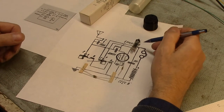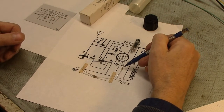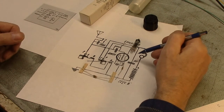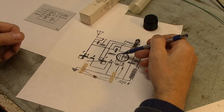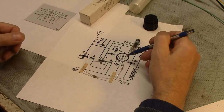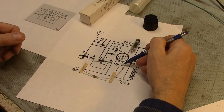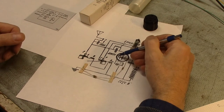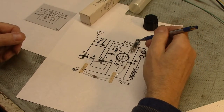Since it's push-to-talk, you'd probably get a lot more than 100 hours of actual use. For use as a detector amplifier here, I probably don't need to push it that hard. I found a neat contemporary article from a Westinghouse engineer involved in the development of the WD-11 tube. He discusses where to place your current control resistor — you want it on the rheostat side, not the other side, or you'll have odd characteristics. He goes into the design of the tube, the glass, the vacuum pump-down process.